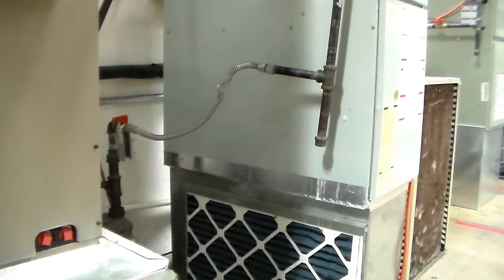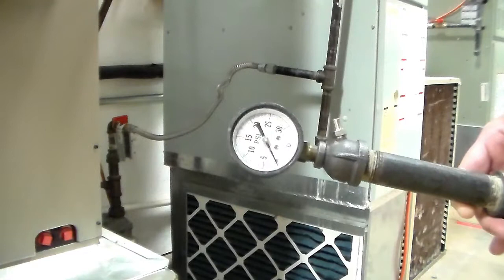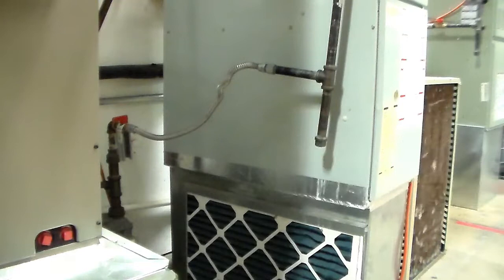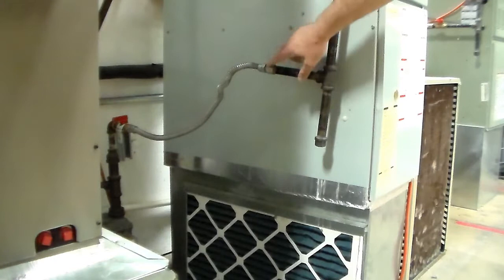For the purge process you're going to start with the gauge attached on the meter end of the pipe, because we can't pressure test the meter — it won't take that 10 psi. Use a 30-pound gauge on the meter end, so you take that off and hook your pipe into the meter. Over here on this end you're going to have a cap, but we can't pressure test the flex.